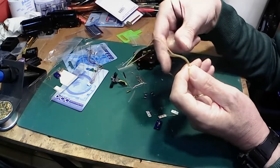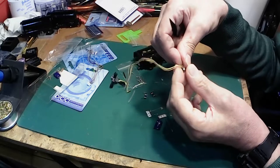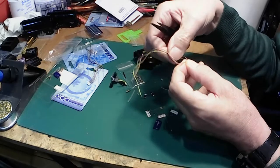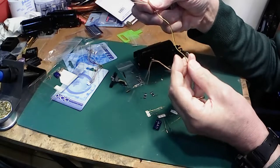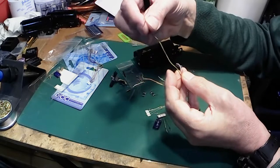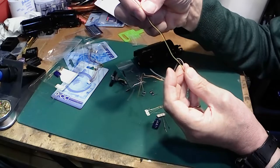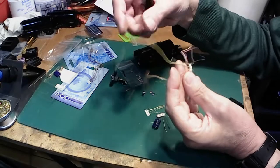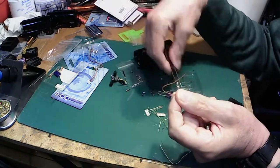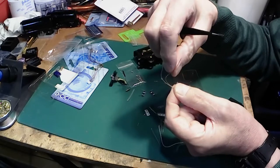So that leaves you with four wires now, just like any other micro chip on your train. You've got two wires, in this case a black and a yellow. They go to the train pickups, you know, your little wipers. Obviously it doesn't matter which one's what, so long as they're not mixed up. One is positive, one is negative from your track. That gives the current to the little brain. These other two is what you connect the LED to. I think it's orange is the plus.